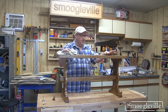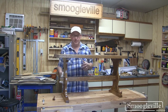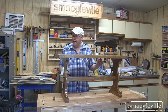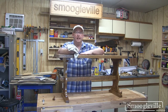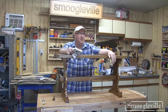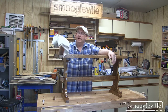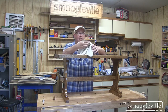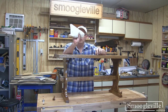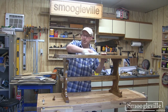I've just put a second coat of the Tung Oil on here, and I say just, I did it yesterday, and it's dried now. This is what I like about the Tung Oil, is it's not greasy. It is slightly sticky still. I think it just needs to dry out a touch more, but I'm going to take a lot of that off with just a clean cloth. It said lint free. I don't have anything particularly lint free. I've just got a well washed old dish cloth here, and I'm just going to use that to